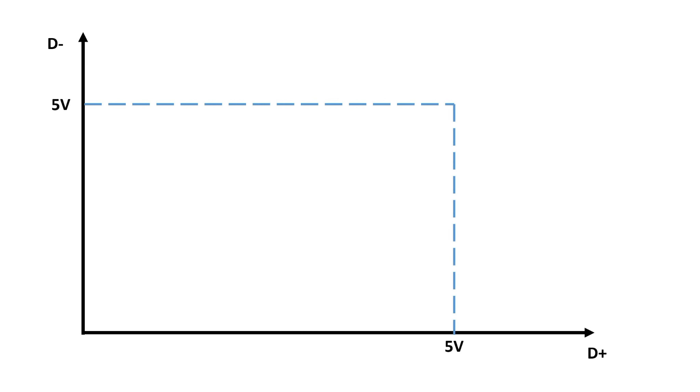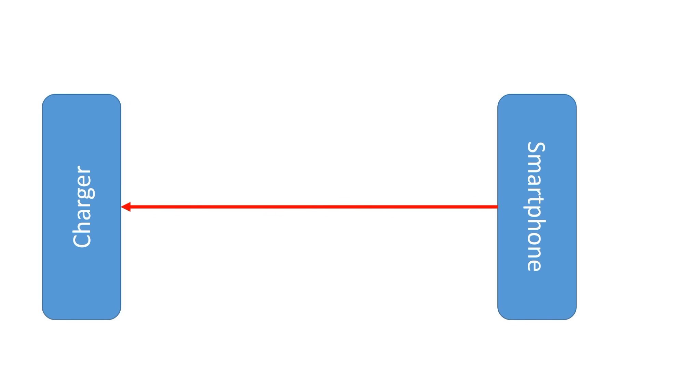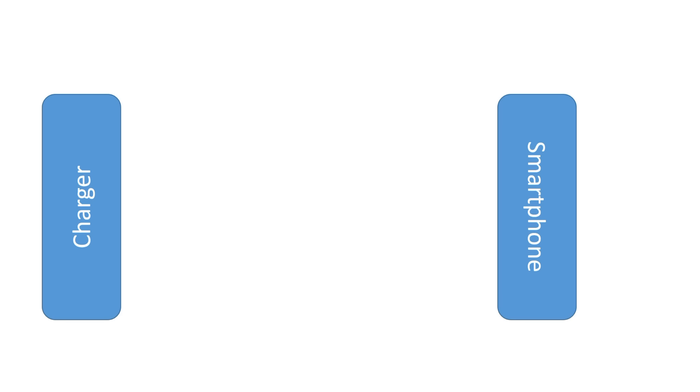Here is how they solved it in QC 2.0. I draw the D-plus voltage on the x-axis and the D-minus on the y-axis, with the 5V limits shown. As with Apple, the signaling is done at different voltages. Because the standard is proprietary, we do not precisely know where the levels are — trial and error were needed by various people to get this diagram. I base my work on Vince's blog. We look from the smartphone towards the charger: the smartphone assigns different voltages to these data wires to signal the charger its capabilities — not the other way around. The communication direction is reversed compared to the Apple standard.